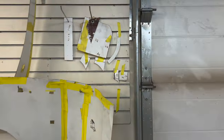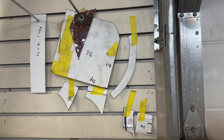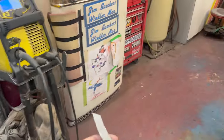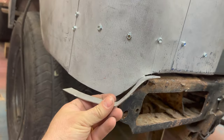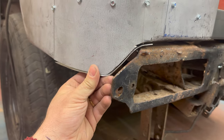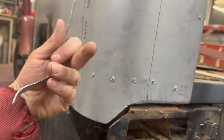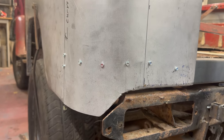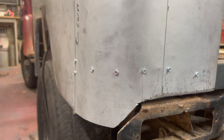On the wall here is that template I mentioned. You know how much easier it makes things to build — on the other side I had to literally prototype all of this, but this piece I just had to cut it out and bend it. I'm going to weld it on the vehicle here, clean up the welds, so that when I pull this panel it holds its shape. It's going to want to flex back a bit on us, so I'll weld this in.